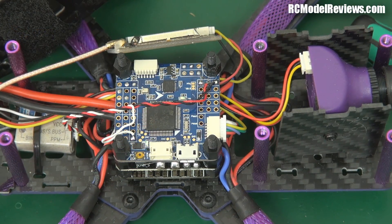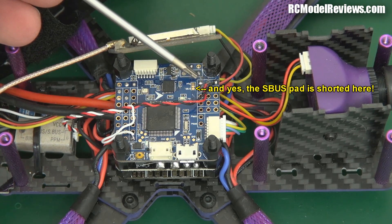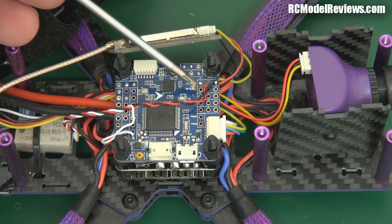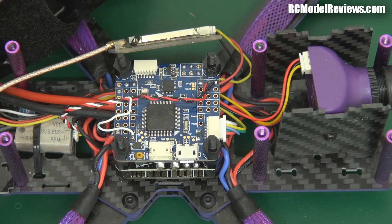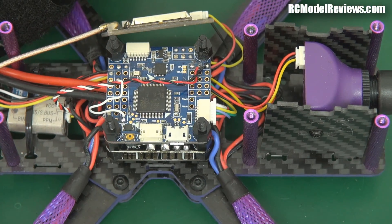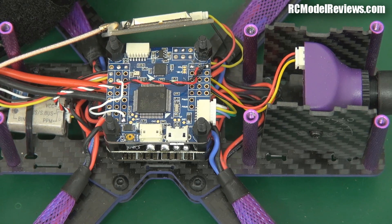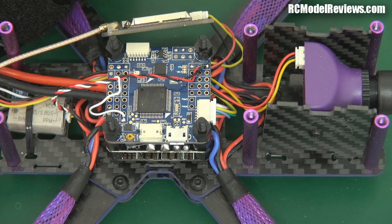Here's what I've done. I've taken the signal lead which comes from the receiver — which was previously S-bus, this white wire — off the pad here, which is the inverting input for UART6 on this board. That's the input that has an inverter on it so you can use S-bus. Now the other side of that inverter is down here — the receive input for UART6. I've soldered it onto there, so I've bypassed the inverter on UART6, which means I can't run S-bus anymore, but I can run IBUS. These little receivers do IBUS and the transmitter does IBUS. So I'm now going to set it up and see if I can get it to work with IBUS. If it doesn't work, then it's actually the UART on the F4 controller that's broken, and I'll have to use a different UART, probably number three.